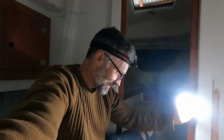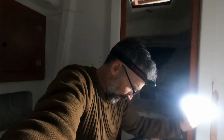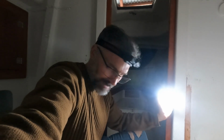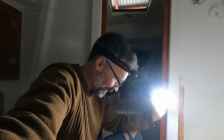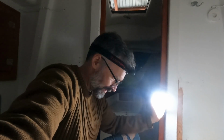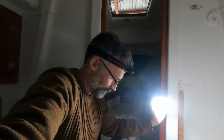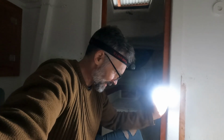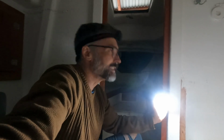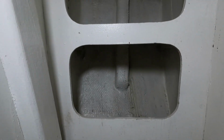Chiseled that last piece out, and I chiseled away any high sharp edge, but later I'll run the sander on there. I'm gonna clean up the floors, so when I'm doing that I'll run the sander with some 80 grit, smooth it out a bit, and later on I plan to repaint all of the interior of the cabin, so it should be relatively clean when it's all done, and then I can build in some shelves into here. Might pull out this back piece as well.